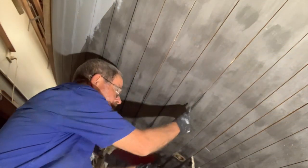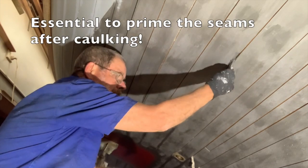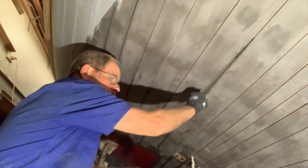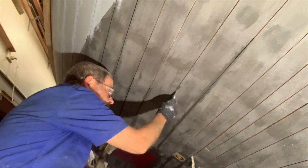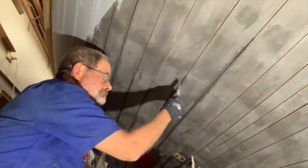The same day you hammer in the caulking, you need to prime the seams and the cotton or oakum for several reasons. Firstly, the primer keeps the cotton compressed, as it has a tendency to decompress or fluff out, especially in humid weather. Secondly, it prevents the cotton from soaking up the oil in the seam compound and leaving it dry and crumbly.